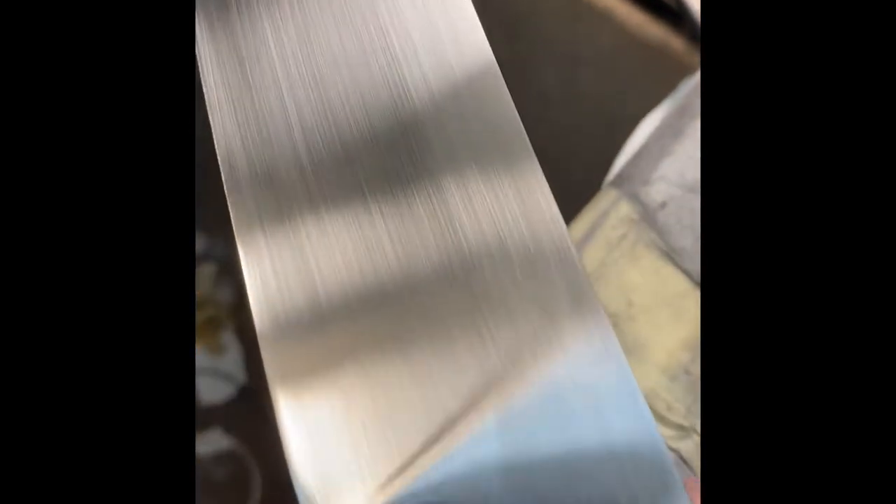Welcome back — hand sanded up to 600, all the way up past where the handle is going to stop on the crossguard area. It does have plunge lines but I've kind of blended them in because I like it to be a little smoother on a kitchen knife. I've got the clip point area all sanded out. Up here on the spine it's not rounded and not flat — there's a very subtle crest, so it has a peak right in the center. The plan is to carry that all the way back across the tang once the handle is attached.